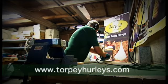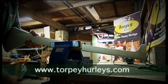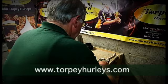I go to the spokeshave to round off all the edges that the planer has left square. The spokeshave is one of the best tools that was ever made, because you can do all the sanding in the world and it will not give you balance on a hurley like a spokeshave will do. If you're able to use the spokeshave efficiently, it's one of the best tools you can have.